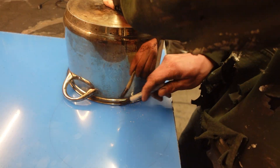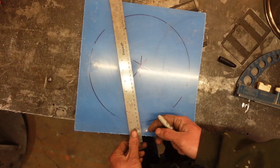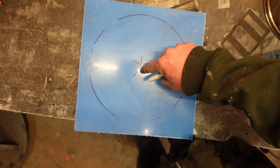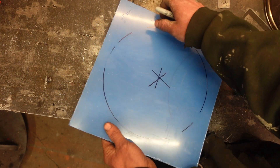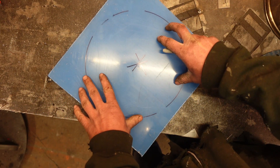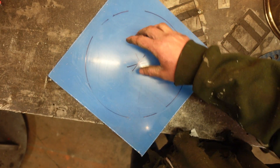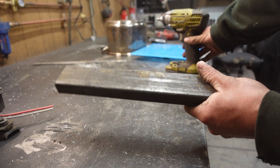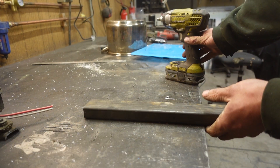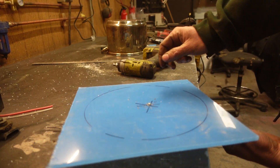So let's start prepping the acrylic. What we're going to do here is drill a hole in the middle and then screw this down to a piece of wood so the whole thing can pivot. Then we're going to stick it on the mill, mill out a slot that we can fill with silicone as our seal, and then mill the rest of it around. Who'd have ever guessed — I don't have a single 2x4 laying around. So this is our 2x4. I think that'll work.